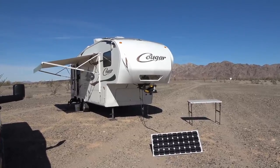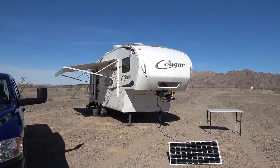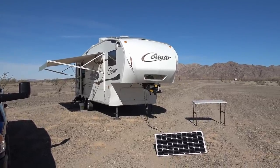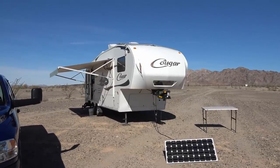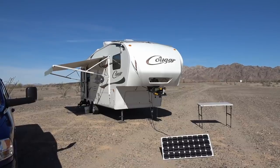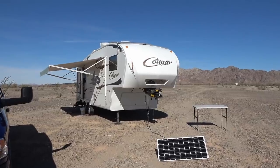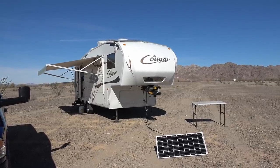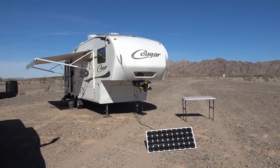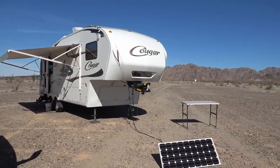Before anybody says anything — yes, I can tilt them. You can get up to 30% more power by tilting, but I prefer not to be climbing up on my roof all the time, mainly because we travel a lot and don't spend a huge amount of time in one spot — a week, maybe two max. Also, the less time on the roof the better. I still have lots of space up there so I could really paper the roof with panels, and solar panels have really dropped in price. And yes, I know I'm running a PWM controller and not an MPPT controller — I'm well aware, thanks very much. Till next time, Ray from loveyourrv.com — thanks for watching, cheers!